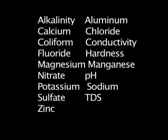You should test every year for bacteria and nitrate. The first time you test, and possibly every five years afterwards, you may want to do a more comprehensive test including things like pH, total dissolved solids, alkalinity, and a variety of other parameters.